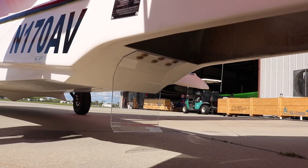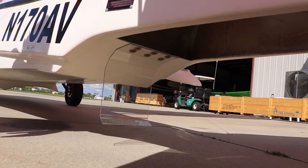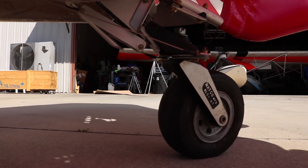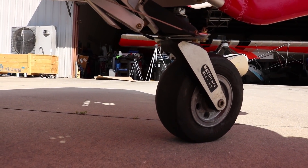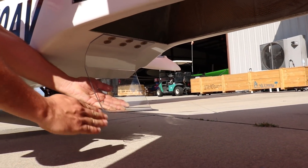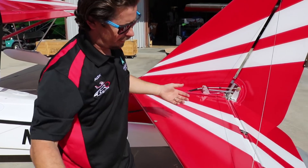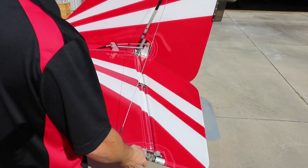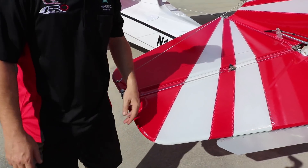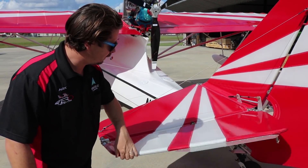What is this here? The splash guard. So this splash guard prevents any water from coming up and over your tailwheel, which can add induced drag and take you longer to get off the water — and it also stretches out your tailwheel cables. The water hits this, folds it up, and deflects the water down instead of over your tailwheel. Checking our controls again — cotter pins are installed, everything feels sturdy, there's no play. Both guide wires are nice and taut, and the elevator has full range of motion. Everything moves freely.